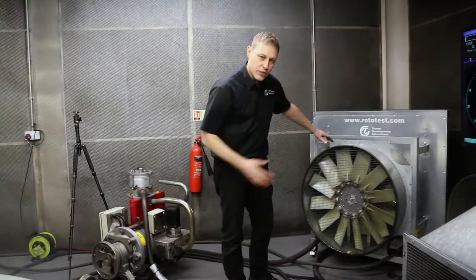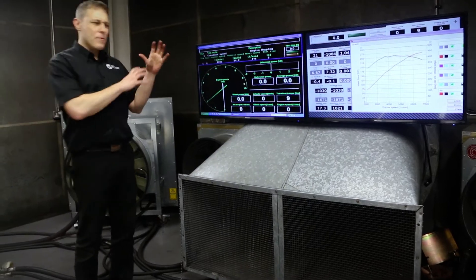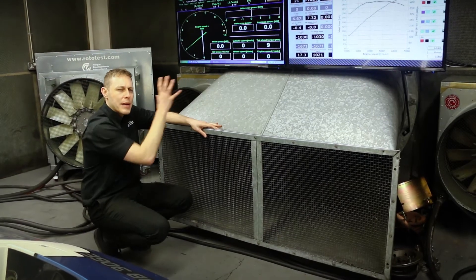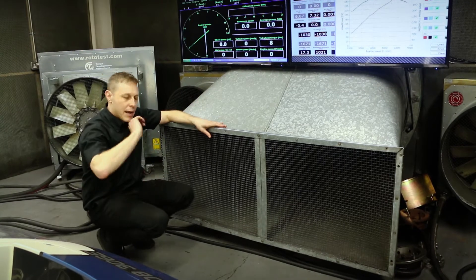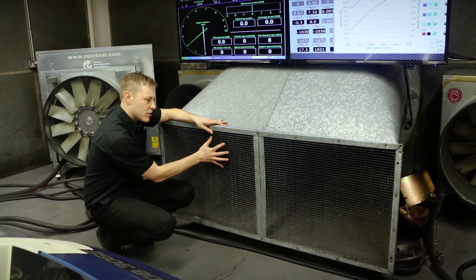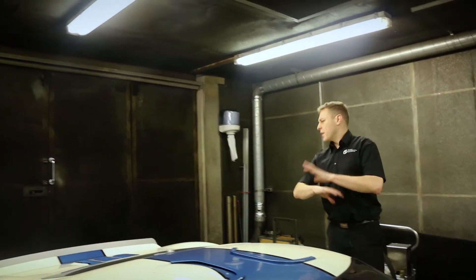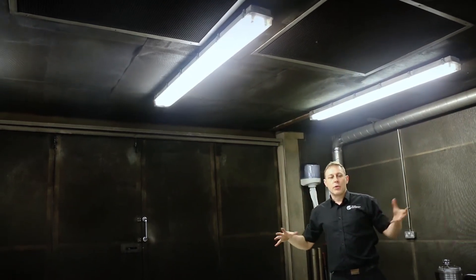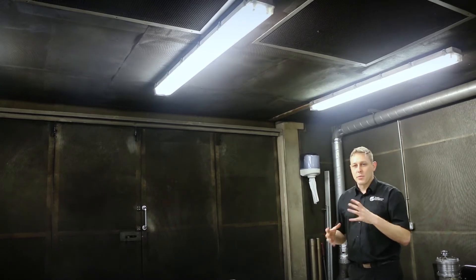Now we're throwing reasonably warm air into the room here, but we want to control the temperature of our dyno cell and we want to cool any vehicle we might have in here testing. So it's really important that we have an amazing flow of air into the cell. This is the output nozzle from a really very large axial fan mounted to the back wall of our building in a whole array of flow conditioning vanes. I can control the speed of this front fan and with it absolutely flat out we can get about 134–135 miles an hour of airspeed here on this nozzle. This air flows backwards across our test car. Hopefully it cools the car adequately and then we have two computer-controlled fans in the roof of the cell at the back here. These go faster or slower as necessary to keep the pressure in the room at ambient. We don't want to run our test cell at above or below ambient pressure for fear it might influence the engine management calibration work that we're doing in here.